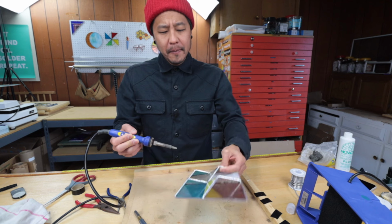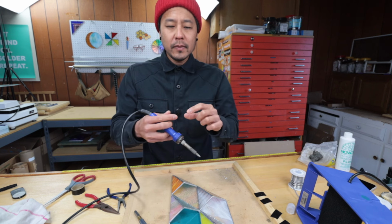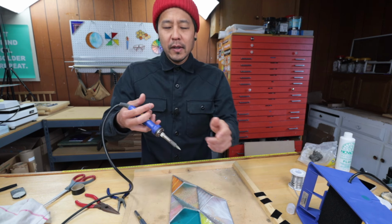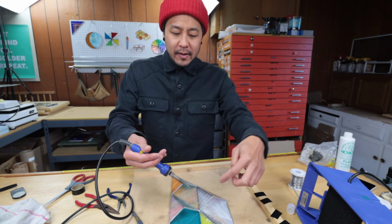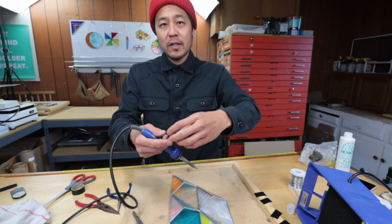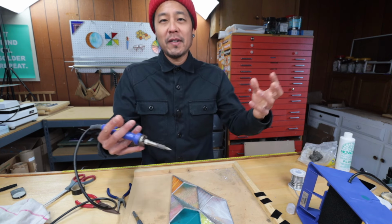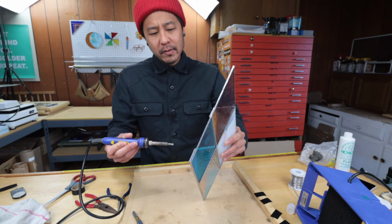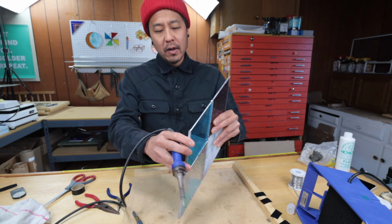And then there's also another thing, a tube that looks like a dispenser, but it's the reverse. You pull it to compress the spring, and then the suction point goes right to the solder, and as it melts, you hit the release and the spring opens up and pulls the solder out into the container. That's the other thing. So in this case, I'm hoping we just melt the solder and let it roll off the piece and onto our board over here.